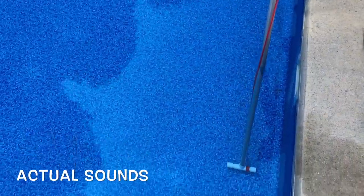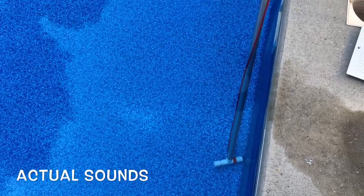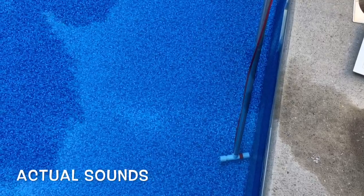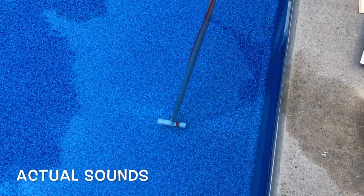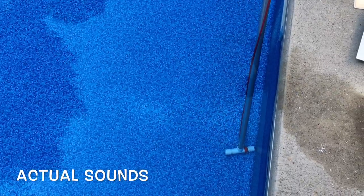So now that we're onto a leak, we're going to let you hear what it sounds like. What you're hearing is the probe detecting a ground — when water is rushing out of an insulated vinyl liner, it creates a ground. Come away and you're going to lose it, come up on it and come away.